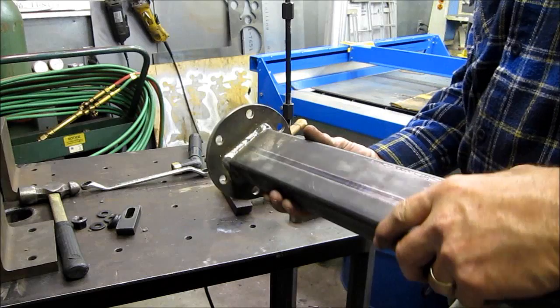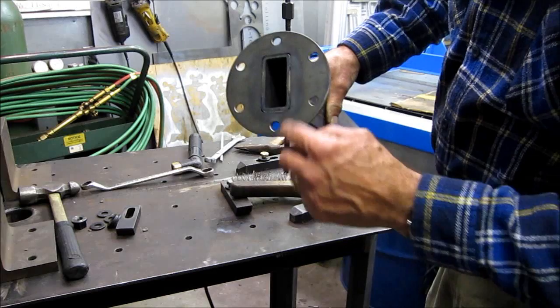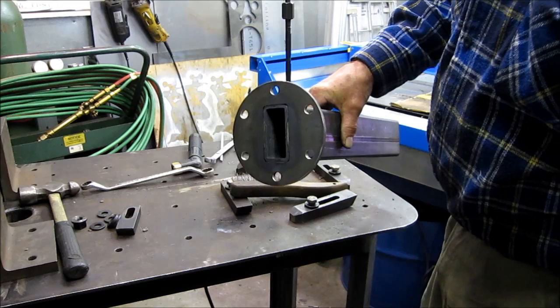And there's our weld. And the important thing is, this is nice and flush. All right, we're gonna roll this over probably with a rotary burr, a little grinder or something, so that we don't drag or scrape any shielding on any wires or damage any wiring. And that'll be the opening of the pocket that's going down.